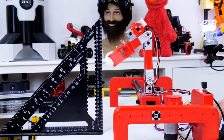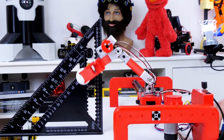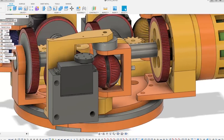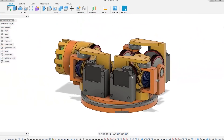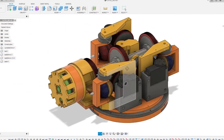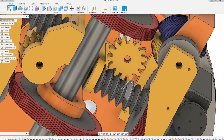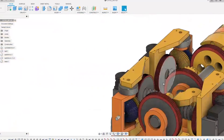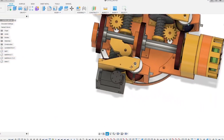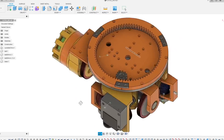Simple inverse kinematics is something I've covered in multiple projects including robot dogs and my simple robot arm projects, but all of these projects had one motor per joint. The new project is going to be quite experimental and probably not very practical but we'll see how it works out. The plan is to have three continually variable transmissions, each driving a worm gear which will allow the axes of the robot to stay locked in place when they're stationary. One output will drive the entire mechanism around on a turntable to make the waist of the robot, and that will leave two outputs which will eventually drive the shoulder and elbow via a differential drive system.